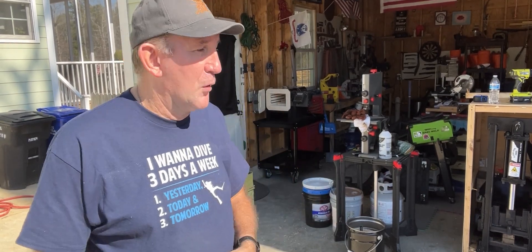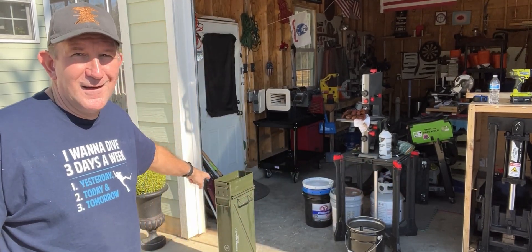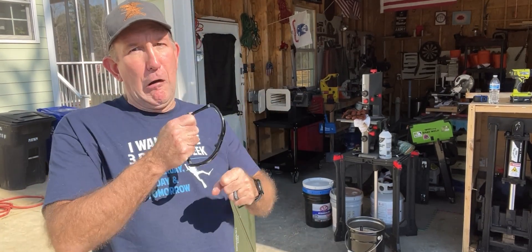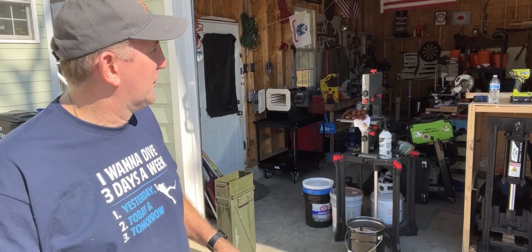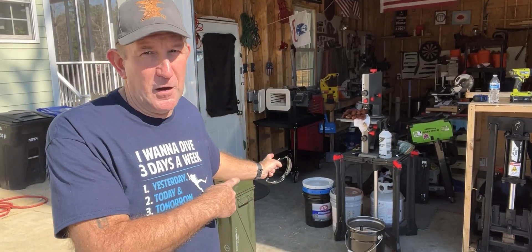I was losing a lot of mass before — that's the difference with precision. I'm not overheating the knife and I'm not having a flame-out show. Although I admit that is fun. When I do some bigger blades they won't fit in the kiln, so you'll still get to see drama — we'll do those at night. Everything's working perfect. Even heat kiln: precision, precision, precision. Repeatable, predictable results. This is Mike at Mike's Workbench in St. Michael's Forge — have a great rest of your weekend and I'll catch you on the flip side when we temper that blade.